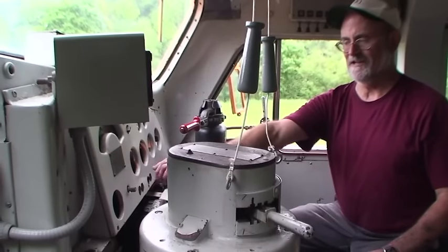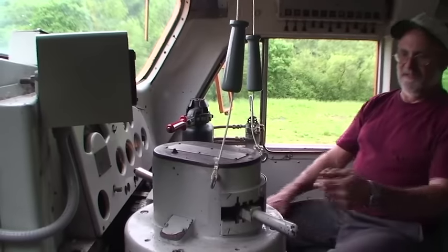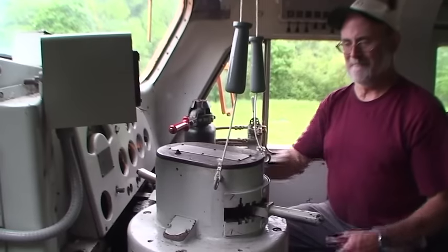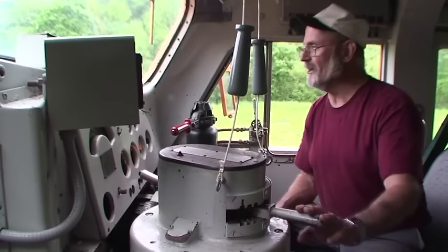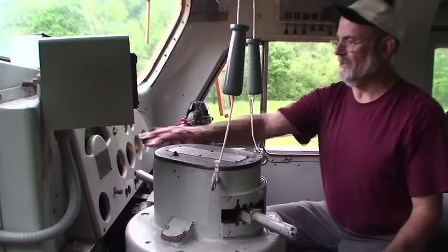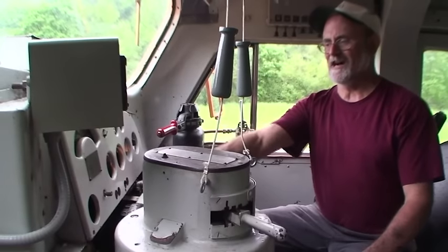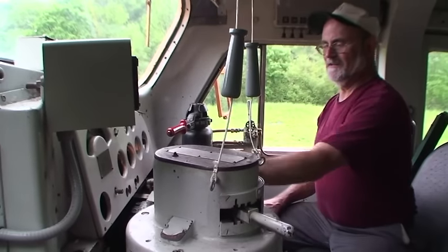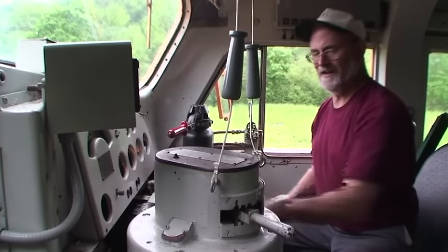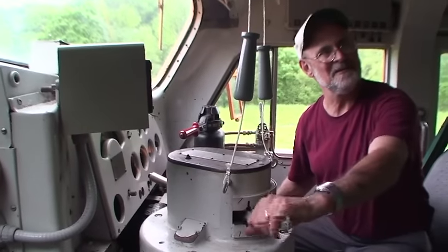Without automatic transition, the engine won't switch down on its own, so the RPMs won't come up properly. To shift manually you'd watch your ammeter — it was a pain in the neck. Say you'd go to position one, watching your ammeter drop back from high amperage. You've got to close the throttle — say you're in the 8th notch wide open — you'd have to go back to 5th notch, make your transition, and then open the throttle again. Which is a pain in the neck.